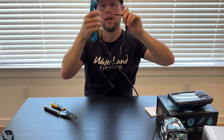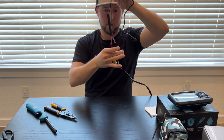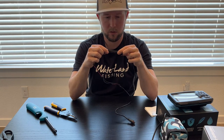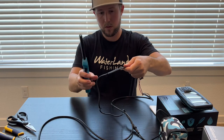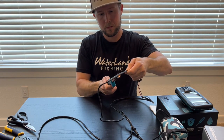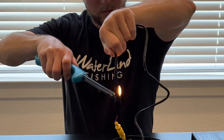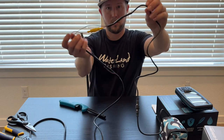That's shrunk down to the wire — helps it stay more watertight. Then you slip this tubing over and do the same thing. I cut this tubing; a lot of people just leave the full length on there, but it's super excessive, so I'm just gonna get it in the middle and melt it down, starting from the center. There we go, shrunk on there, secure.